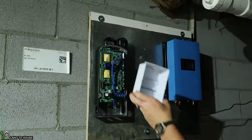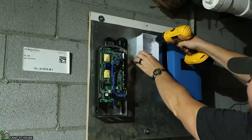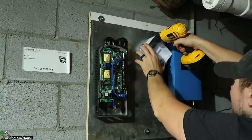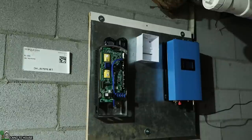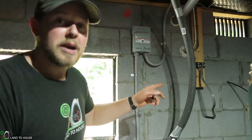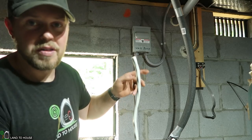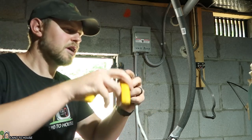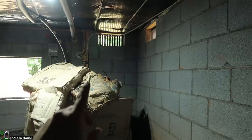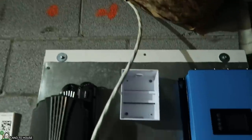The last thing for this part is to get this little breaker box installed. I'm just going to come up here right here in the middle and drill a hole. It's just a little plastic box, so it doesn't need a whole lot. Now I need to get the wire from the rectifier over to the breaker box. I was given some 10-3 wire that's not ground contact — it's going to be perfect for under the house. I'm going to use my wire strippers to strip the outer sheathing off a little bit, and then we will get it connected to the rectifier.